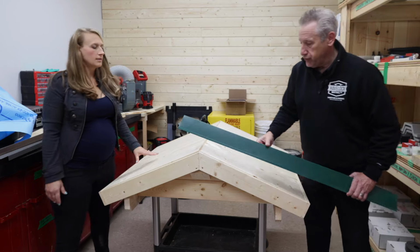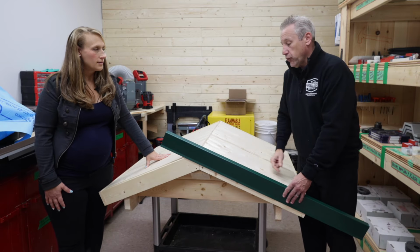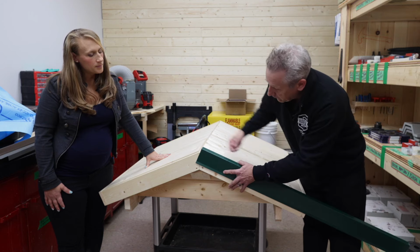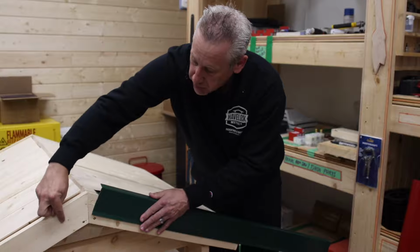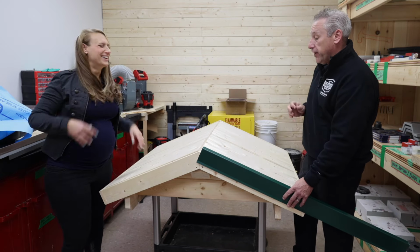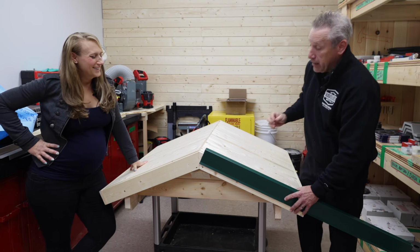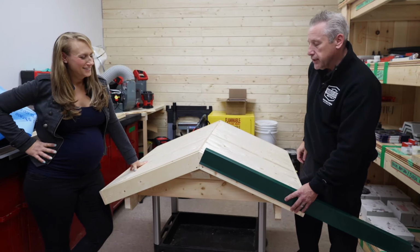So the flying gables, mounting them. We usually have lots of leftover. So what you want to try and do here is, some people want to stop it and try and miter a cut to that actual degree to fit the front here and then have the two pieces butt together. Yeah, which is not uncommon because frankly it's the easiest way to do it. But the reality is you've created a seam there. And unless you're real tight, it's going to leak at some point.